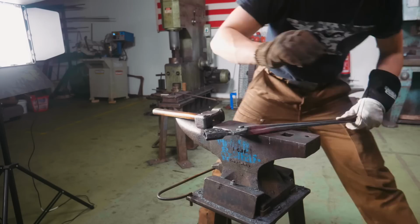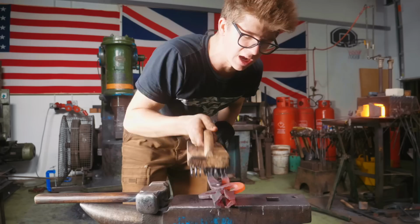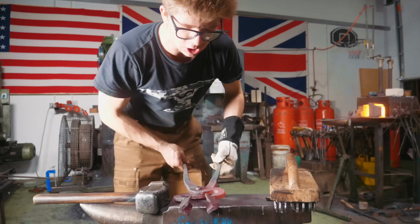So these ended up not really looking too much like Ballard Forge's tongs, Steve's. They actually ended up looking a lot more like an industrial tong than my friend Mark Krauss always likes recommending. You got this nice flat here at the back, which means that as steel gets hammered in this way, it's actually not opening up the tongs. In fact, it kind of goes back slightly, so it's closing the tong jaws.